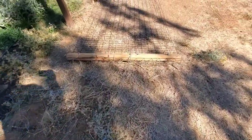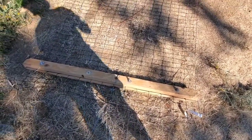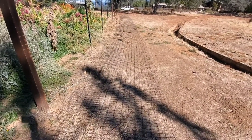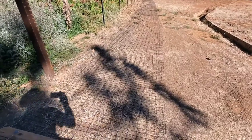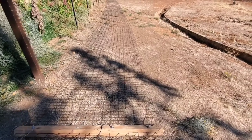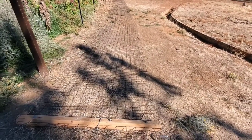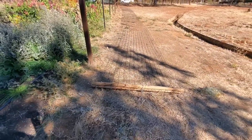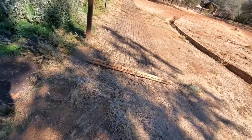And in this particular case, I put the pulling bar together on the ground here. I had the wire leaned up against the T-stakes and it fell over. So if you get in a situation like this, if you're by yourself, it's going to be pretty difficult to get that wire leaned back up. So what you need to do is just get it close to the posts and just start cranking.